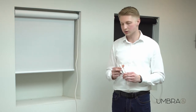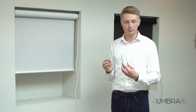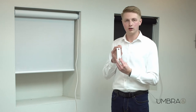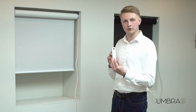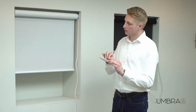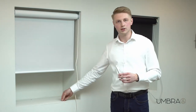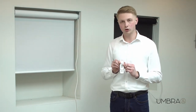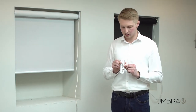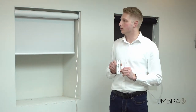The last step is very, very important. For this, you'll need a paper clip or a ballpoint pen — something you can put into the hole on the back of the remote control. The programming button is on the back of the remote control, and by pressing this, you'll get a shunt from the blind. This confirms that the motor is now out of programming mode and ready to be used. A single press of the up or the down button should now make the blind travel by itself. It will travel up to the top limit position and stop.